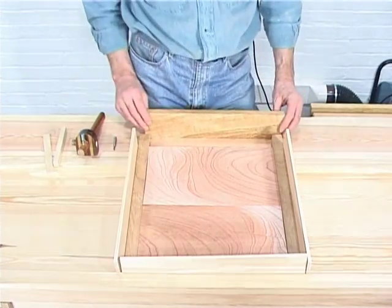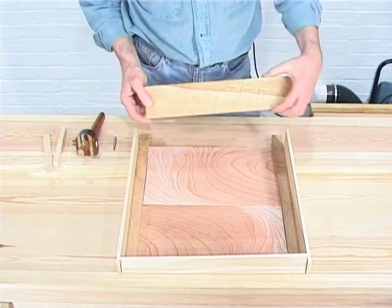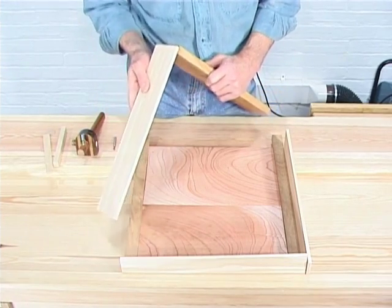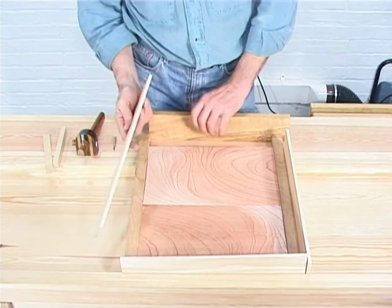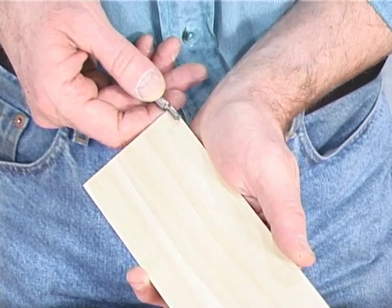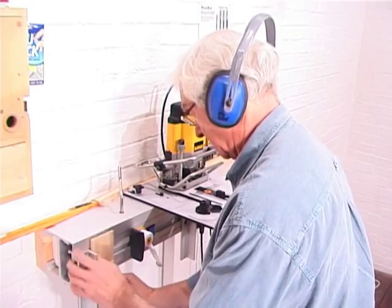Here are the prepared pieces. The front is selected for its decorative quality, and it's thick enough to take any veneer, moulding or inlay or decoration. And the contents will try and hammer the joints apart over the years, so we need nice deep dovetails in the sides. The wood of the sides is traditionally light and quite thin. Unlike some jigs, the Woodrat has no difficulty with this thinness, nor how closely you space the pins.